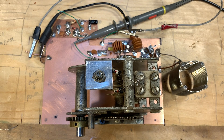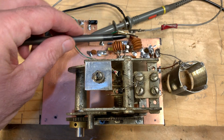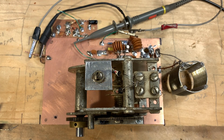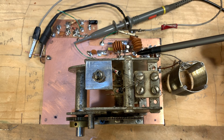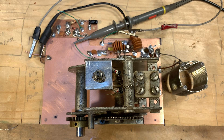I do think that made a lot of stability improvements. I bolted everything down pretty solidly — the PC board is screwed down to the wooden board underneath it, and the caps are very solidly in there, not floating around. The feedback caps are about 680 picofarads. I had to put about 130 picofarads in parallel with the main tuning cap to get it in the tuning range, and I needed about 300 picofarads to go from the gate of the FET to the coil and cap main tuning arrangement.